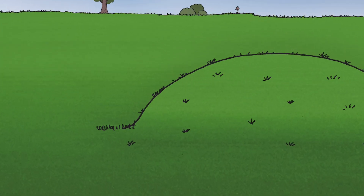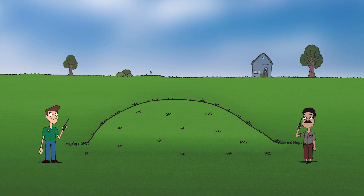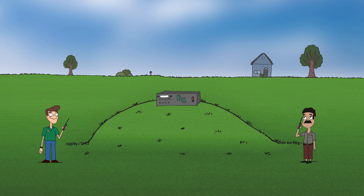With a repeater, you can essentially send your signal close enough to that repeater, it'll take it and then rebroadcast it out at a higher power. So if you've got one person over here and one person over there with a big hill in the way, if you can transmit to that repeater, it takes the signal and rebroadcasts it, and the other person can hear it even though there's a physical obstruction in the way.